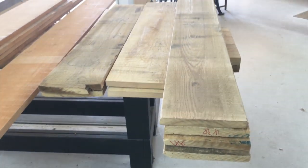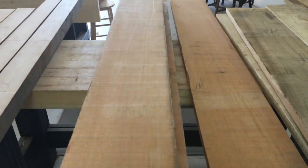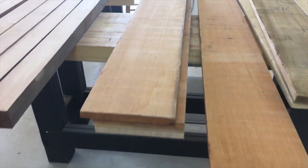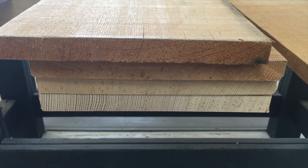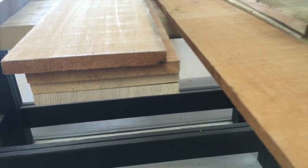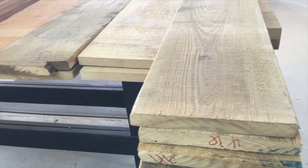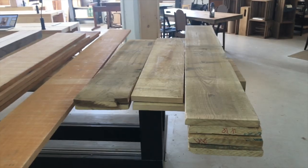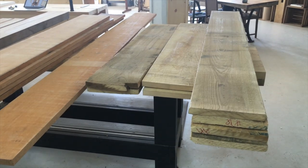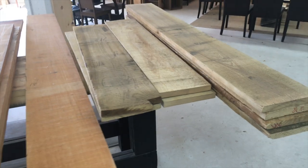I'm not quite sure how that's going to work out, but I at least know the base and the footing section will all be out of fir. The exterior and doors of the cabinet will be out of four-quarter Douglas fir. Most of the interior components — drawers, all that kind of stuff — will end up being out of cypress. One thing to consider when you're going to a mill: you may have all the best intentions to get the perfect material, but if they don't have it, either you go home empty-handed or you make some decisions on the fly.